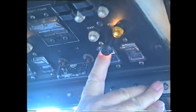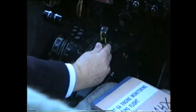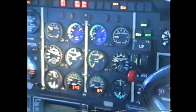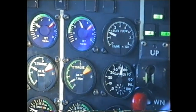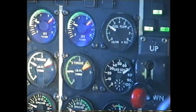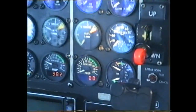Second engine. Current less than 200 amps, starting second engine. Start switch — 1, 2, 3, ignition — and fuel lever. Stabilised at 19%, fuel lever forward. ITT: 400, 500, 600, 700, 720 and falling. Start sequence finish, stabilised at 71%.